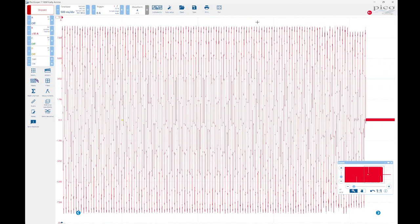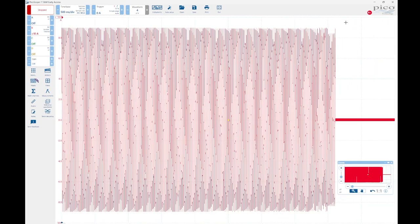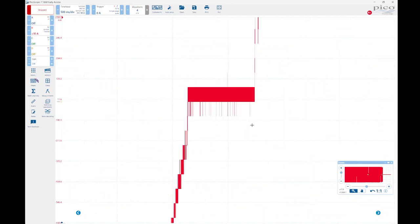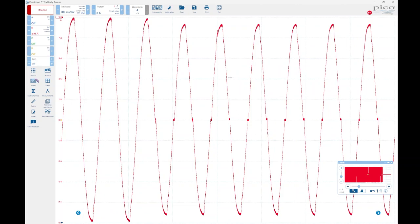normally it's a resistive load, it's just a heater. So what we see is a nice sine wave. This is the current, remember. So you see a nice sine wave for the resistive load. Where it's arcing, right before it drops, you see these little discontinuities. And this is actually because there's some voltage that it's got to flash over. So if you looked at this in the frequency domain, you should see potentially more obvious high frequency components.